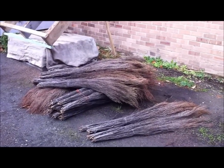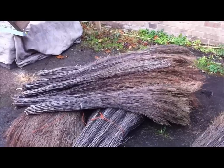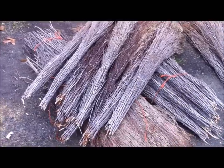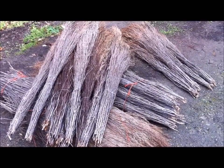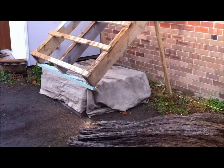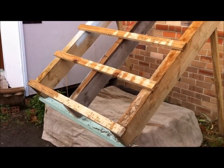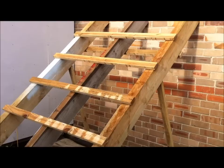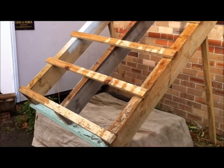This is an installation demonstration video for how to install a thatch roof using AusNative Quick Thatch pre-wired bundles. The first step to building a thatch roof is to set your roof battens out at 450mm centres. We've built a demonstration roof here to show the different styles of thatch roofing and techniques used.